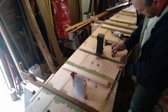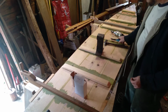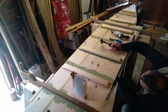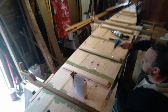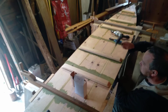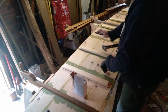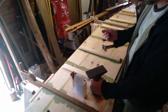Yeah, so the nails and burrs are the number 10 copper nails, and the number 10 burrs, which are a little bit more than finger tight. You can push them on if you give a good push, but it's a lot easier on your hands if you just tap them on with the hammer when you go to snip off the end of the copper nail.